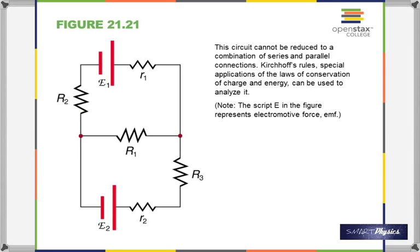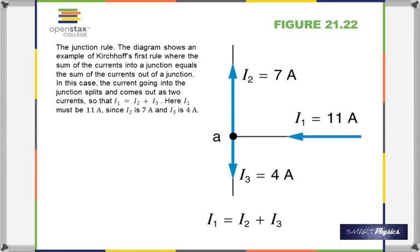I'm seeing if you're paying attention. If you're able to answer when I pause, then you're paying attention. Otherwise, you are going to be in trouble soon. So there are three electrical networks. Is that clear enough? Now I can take you to the laws. The first law applies to a junction, and the second one applies to a closed network. So the first one is easy. I mean, both are easy, but this is the first one. The total currents meeting at an electrical junction should be zero. So the total sum of the current should be zero.